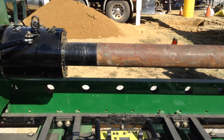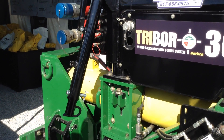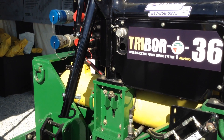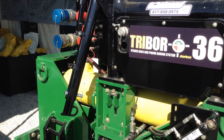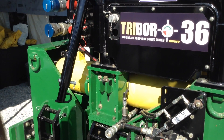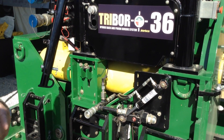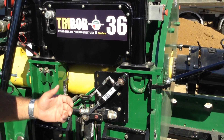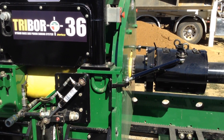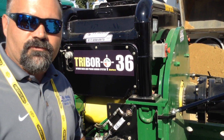Back here I'll show you what the cylinders look like. Jump into cylinder mode if you start running out of push-pull with your rack and pinion — you go to 500,000 pounds of push with 375,000 pounds of pullback. So it's a very versatile machine as a directional drill — basically a maxi-drill. It'll fit in as small as a 16-foot pit, and you can put as much track on it as you want and do 80-foot pushes for casing bores on pipelines.